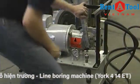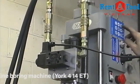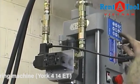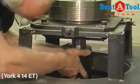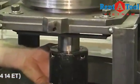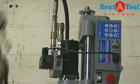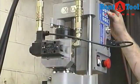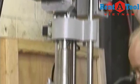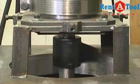For larger diameter bores, we suggest our 5 horsepower hydraulic bar drive. With 5 times the power of the electric drive, this bar drive with our large bore options is capable of bores of up to 24 inch diameters. We use a hydrostatic drive that provides forward and reverse rotation with varying bar speeds. Bar speeds are available from 20 to 140 or 60 to 180 RPM, and depending on the user's applications, motors are available up to 500 RPM.